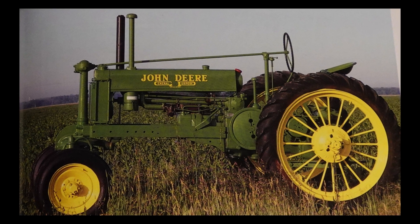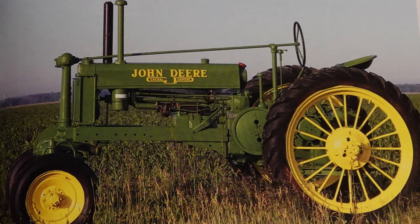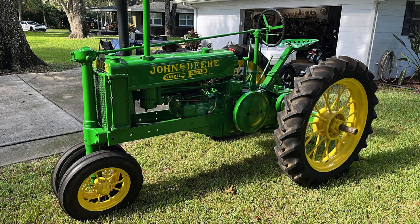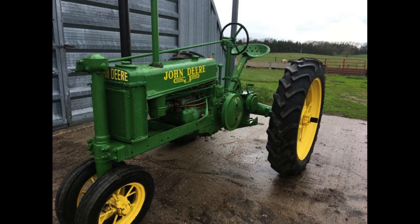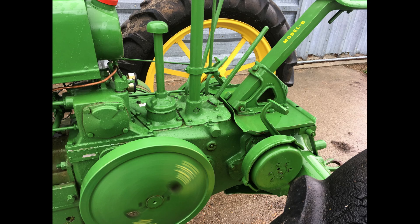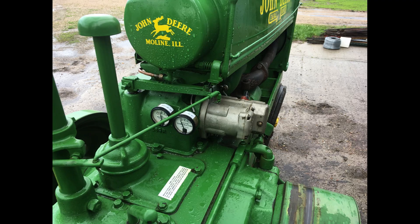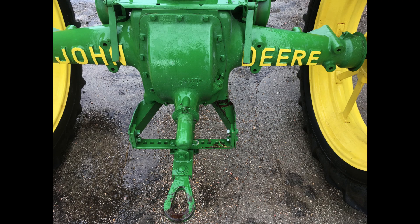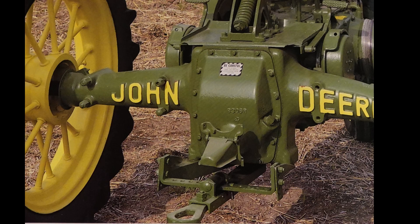Between 1937 and 1938 you'd see another update to the Model B — the frame would be extended by 5 inches. Many of these early Model B's shipped with steel wheels but the rubber option was also made available. The Model B would compete very well with the F12s on the market, holding up both power-wise and price-wise. For the transmission, the B had four forward speeds and one reverse. John Deere had to take things from the A but also redesign this transmission to fit inside of the Model B, changing the gear ratios to keep the output speed at the required RPM. Another little-known fact is that these John Deeres are often referred to as having the teardrop drawbar — a loop drawbar only made available from 1934 to 1937 on the A's and B's.